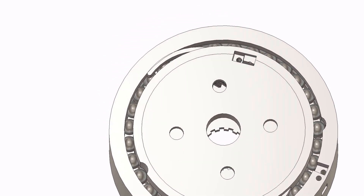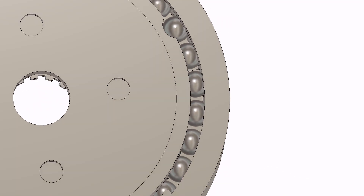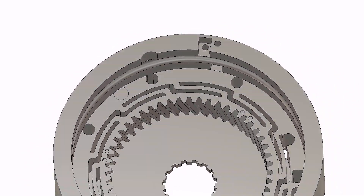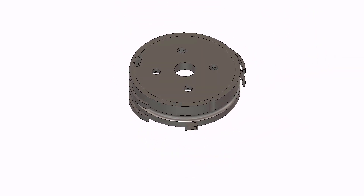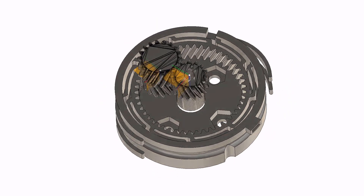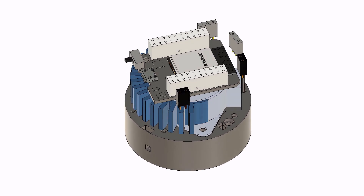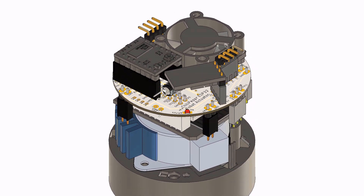The bottom of the actuator has new acrylic balls — we're no longer using Airsoft BBs. Those little arms are the slip ring arms to carry 20 volts via copper contacts inside the actuator. Inside are the planetary gears, and there are expansion joints that are flexible to provide anti-backlash. There's also a connector that holds a 3×1.5mm neodymium magnet and the raceways where the gears fit in the top unit.